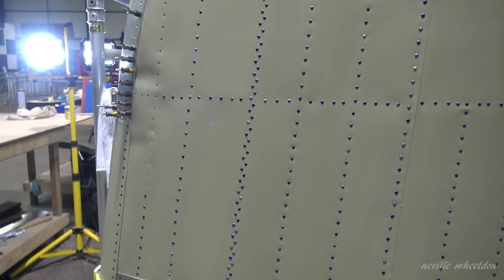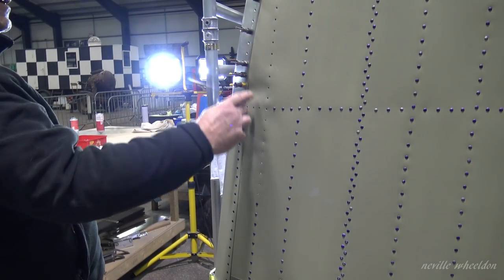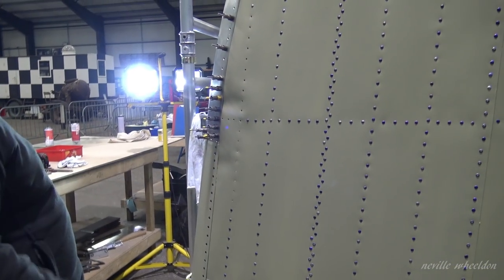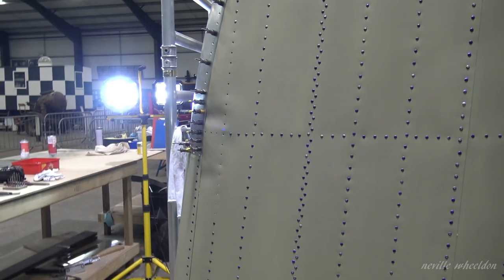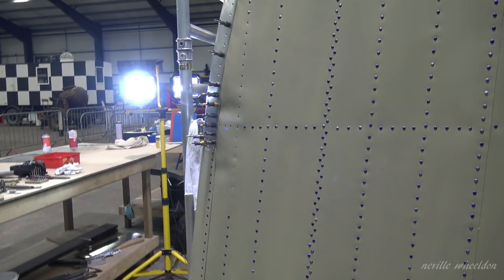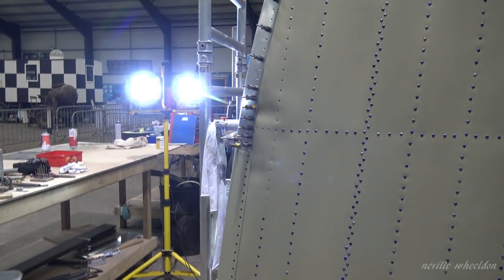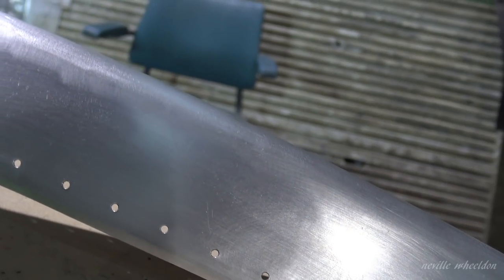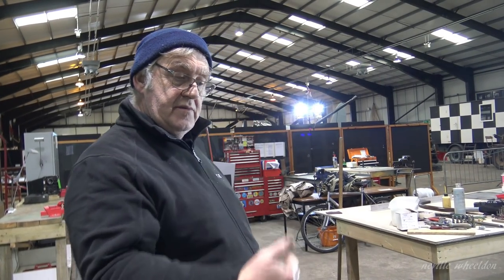You couldn't get that by crimping it or shrinking it at the edge? No — it's actually in the material itself. Because it's rolled and shaped that way and that way, the material's got nowhere to go. It looks good though — neat up there. It came in with all the edges chamfered and then I turned the edge of it very slightly so it's got a slight curve in. So when it meets up, it actually pushes down and then pulls up, which keeps it nice and tight.